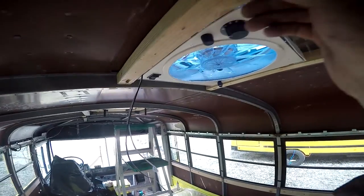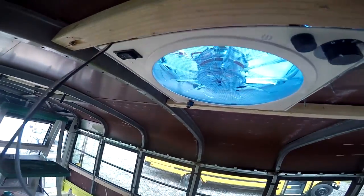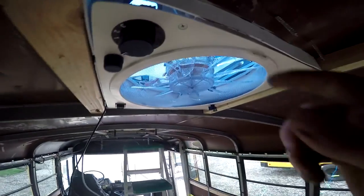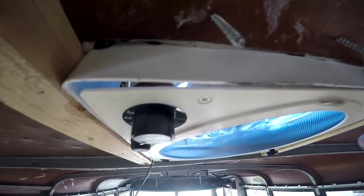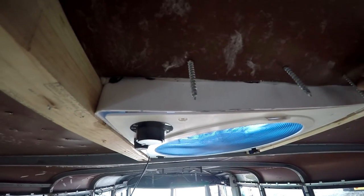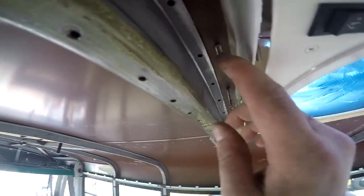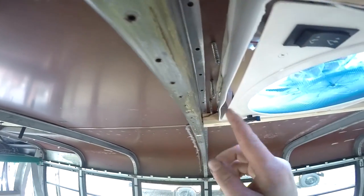So the fan is in. The screws that I put in even go all the way through the wood, so they hold it and it doesn't move at all. You can see some of this caulk that I got up in there, and then the seam sealer covers it all, so no water is going to come through at all. I think we're all good on that. I'm going to trim these down, and then spray foam will be going all throughout.